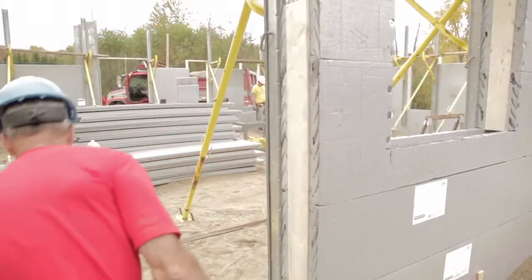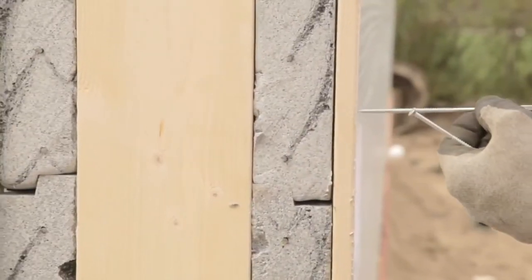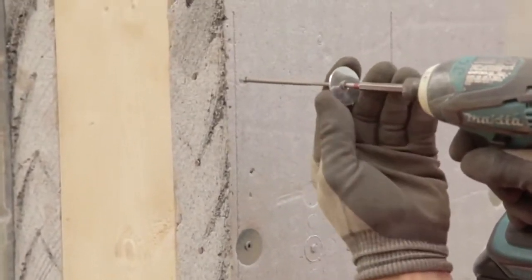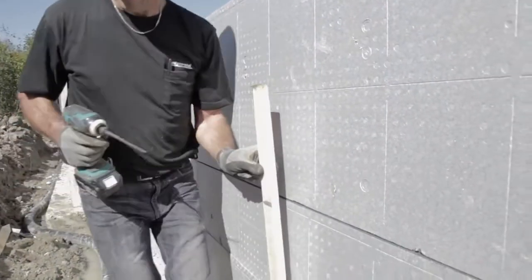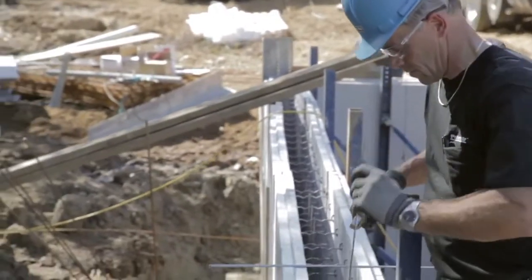Wood frame bucks are strongly fixed on their interior and exterior perimeters with wooden strips with 4.5-inch number 8 screws or with metallic washers using 4-inch number 8 screws. The topper block row is attached to the previous one with wooden strips on the exterior of the wall or with anti-lifting rods into the formwork.